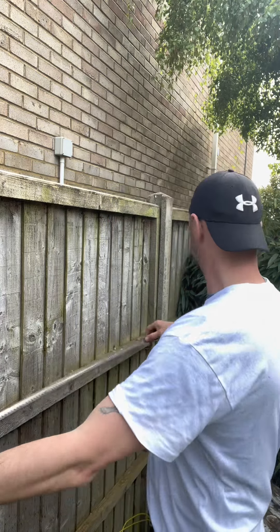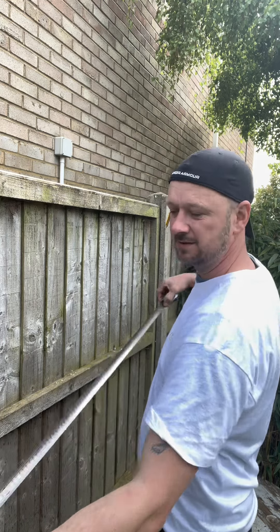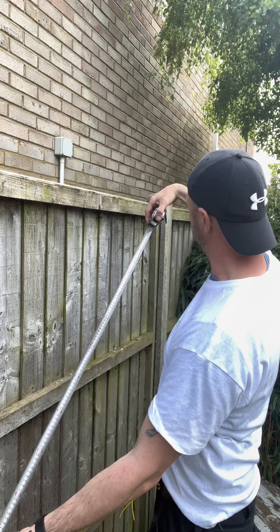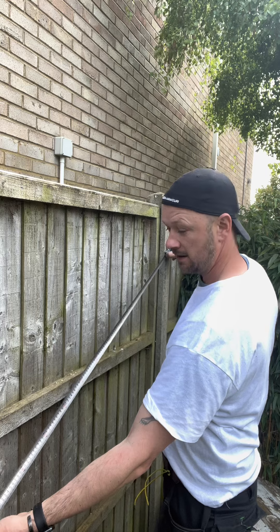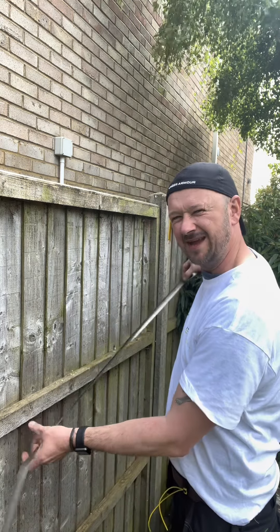This one is for people that are crap with numbers. When you're measuring 179, and you need 179 divided by 2 — yeah, that takes too long. So stick your tape measure at 2 metres and lay it across diagonally. One metre — that'll get you the centre.